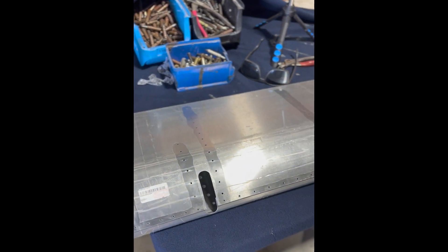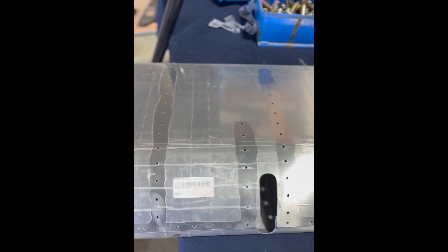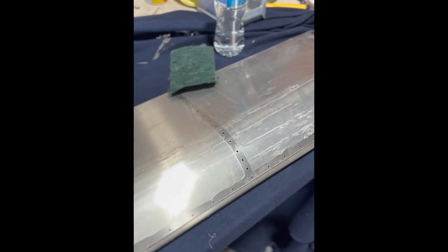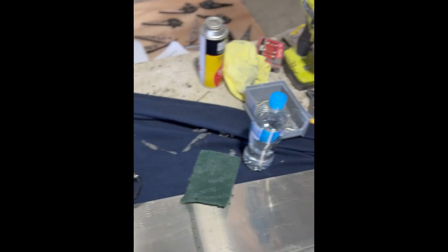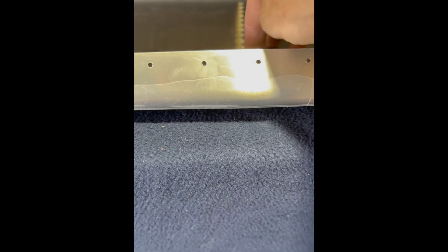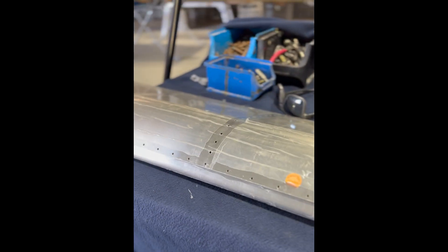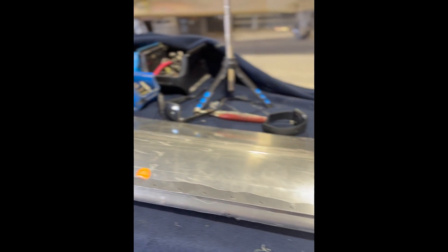Still preparing the skin — it's essentially the same process as building the ribs. I'll go through and scour all the rivet lines, use acetone to clean them down, and tape these lines here. On the inside we'll be adding the corrosion protection paint, making sure anywhere metal is touching — the inside here and underneath — will all be painted. Then hopefully by that stage we've got the aileron pretty well done and can start on the next step.